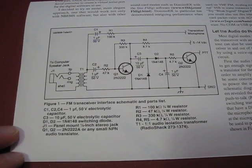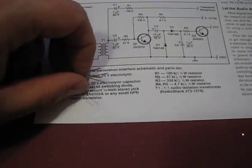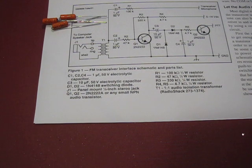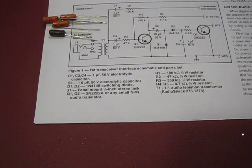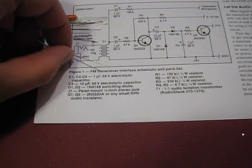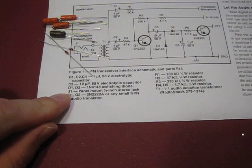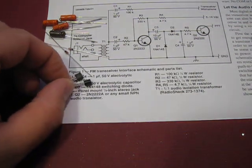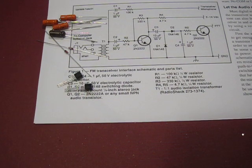In your kit you should have the schematic with the parts list on it. You have three 1-microfarad capacitors, a 10-microfarad capacitor, and two 1N4148 signal diodes. J1 is part of the cable so we skip over that — I'll get into that later. You should have two 2N3904 NPN transistors. Double-check the part number; it should say 3904 on them.